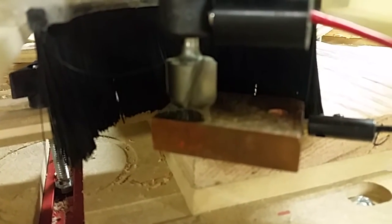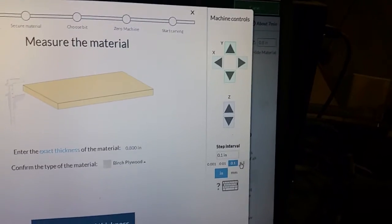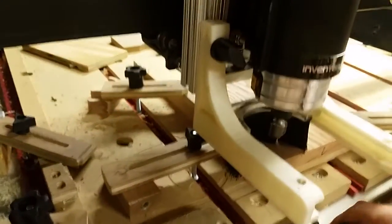It's going to go down, make contact, and stop. Okay, it made contact. From here, go to Carve. I have a lot of Z room so I can send it up an inch — I have about four inches of clearance above it, so I'm going to send it up an inch. Take the probe off, then I'll go down an inch.